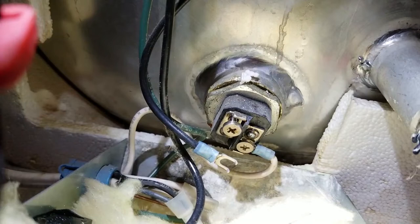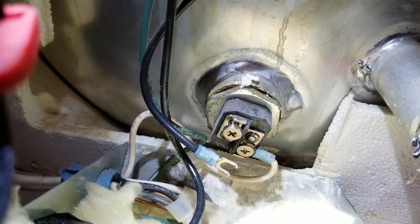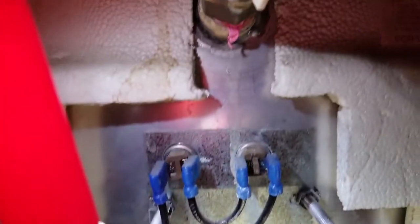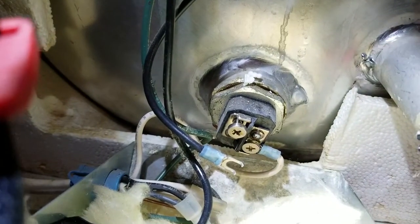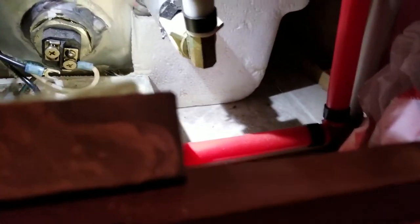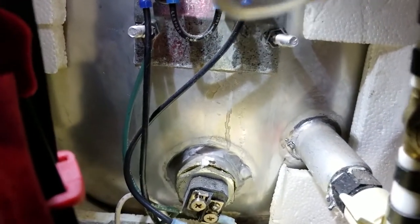So at the end of the trail we've been following, on this one, we're following the trail of 120 volts, and we verified that we had power coming in, and we made it through our first thermostat. We didn't make it through the second thermostat. We reset him, and we've also verified that that's good. So let's button all this up and fill the tank with water. We'll check to make sure our leak has been repaired here, and then we'll try it on gas and electric and see if we have a happy camper.